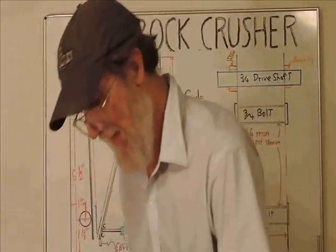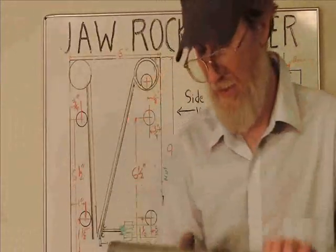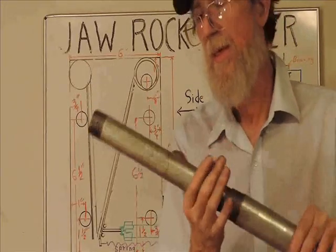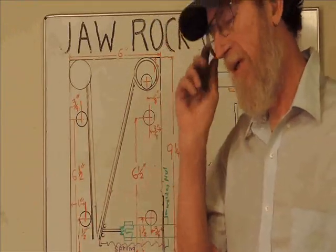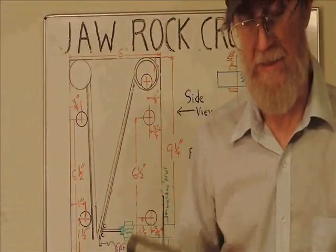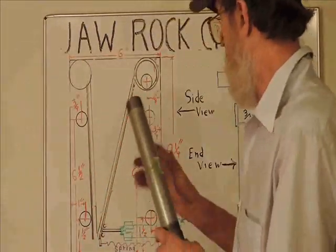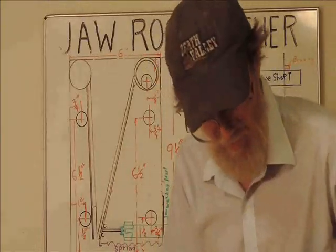Now there's another thing you might consider, which is moving up to the next pipe size. This is galvanized pipe, but you'd be using black pipe, which is the same size. They don't quite fit. The threaded portion does fit, so you'll have to take some of the metal off. That's one reason I didn't use it. You can set it up on a drill press and grind it. You could even take a wood lathe, put a piece of wood in there, spin it that way and sand it down. But you'll have to get it where the two fit together. You may want to run a cylinder hone inside the outer piece. But using this would give you more options on throw. Also, you could take this piece, which is 1¼, and fix it in there.